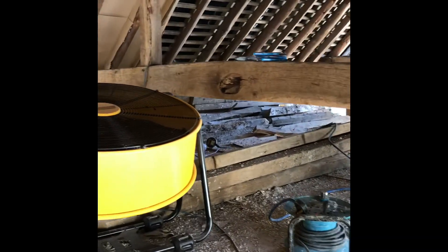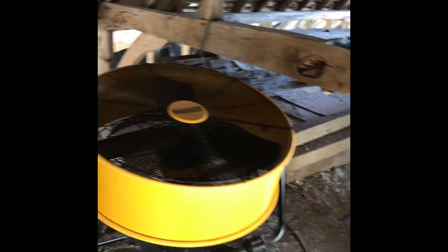Obviously with clay binder you need to dry — it needs a lot of drying, so I've got these three pretty cool fans. The underside is just shuttered with cardboard; I've stapled cardboard up and they're attached to the original tile battens. This side where I've taken the cardboard off is the dry side. I'll just plaster that once it's all dry and the roof's on.